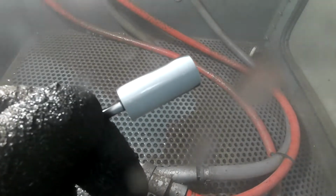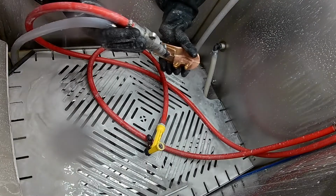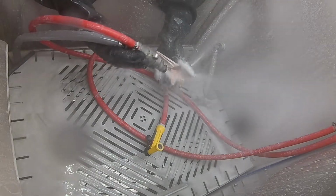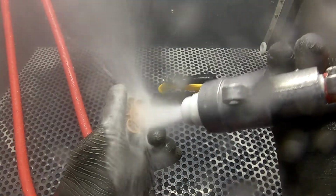Also with the anodizing process, it's essentially staining the aluminum. There's no film thickness there. Media embedment with anodizing causes the anodizing to fisheye, meaning that there's abrasive embedded in the part, so the anodize doesn't really want to take to the part. PVD coating's the same, it will fisheye as well.